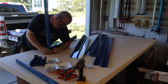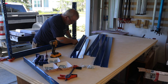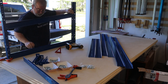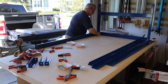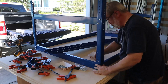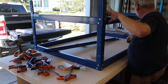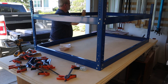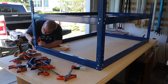This system is made by Kreg and they have a bunch of different sizes to fit your need — this was the biggest size they had. A couple of quick notes: I did find it useful to build the thing upside down to make sure the top was as flat as possible. Second, don't use the world's strongest impact driver when assembling this — I ended up stripping one bolt with a basic DeWalt driver. Just use a little caution: tight enough is probably going to last you a while. I put a little Loctite on my bolts and it's not going to come apart anytime soon.